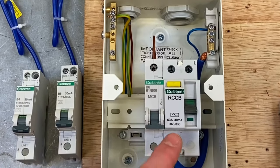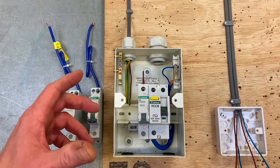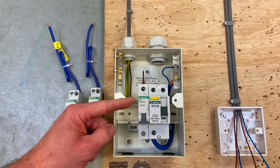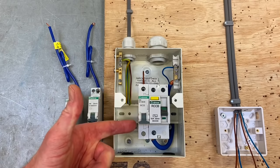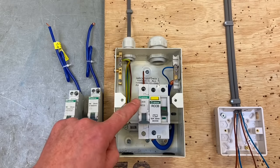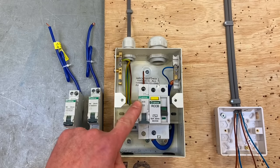My students will notice we've got the AC waveform, and we're aware that we're not massive fans of AC RCDs. We've got our overcurrent protection device — it's B6, so rated at six amps, and it is a type B for the domestic dwelling we're simulating. It could be a type C or D, but we've got a type B here. So: RCD protection rated at 30 milliamps, and a 6 amp type B circuit breaker.